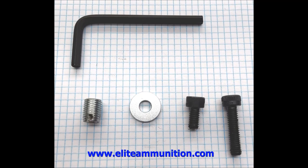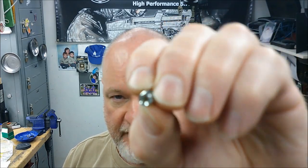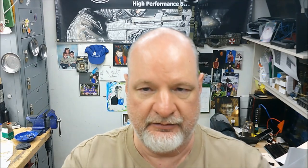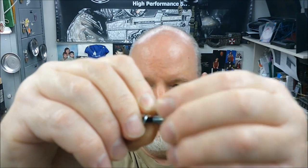If you don't feel comfortable, you can always send it to me. Essentially what this kit is: you're going to drill this hole out a little bit, make it slightly larger, and install this insert. You're going to insert this threaded sleeve — it's designed to thread into soft metals like aluminum and stay in there. We're also going to add a little adhesive to make it easier. Once it's threaded into the stock, you'll have this little 3mm hex-head M4 screw that will thread in and out of this insert, making it a nice permanent and repeatable procedure to hold your stock in.